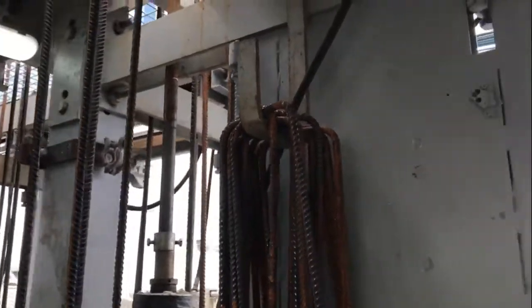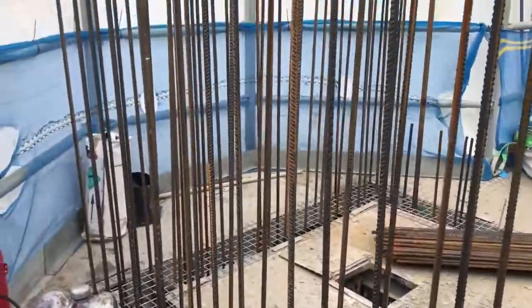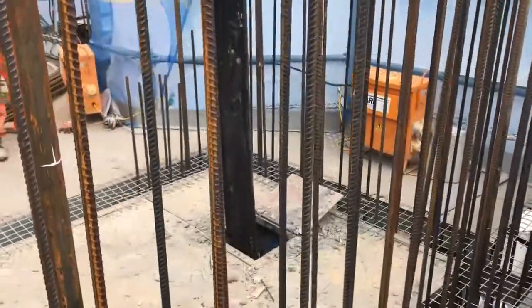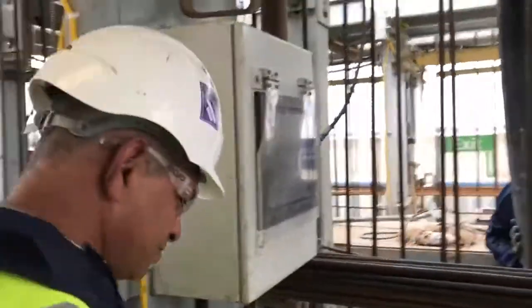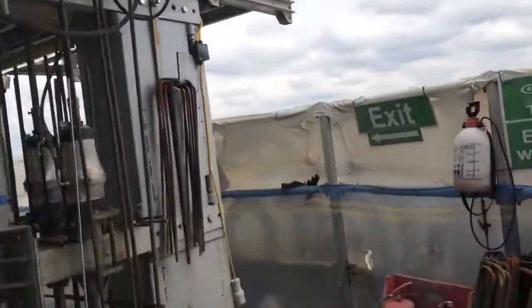I'll try to show you from the top how it looks and we'll have a look at the view - maybe say hello to the crane drivers. These are proper steps rather than a ladder. This steel slip form is different to some I've worked on before which had wooden platforms - this is made to measure and assembled on site. Now there's a laser showing the position, so it's plus 5 or minus 6 - you don't even need to measure old school with the tape measure down there.